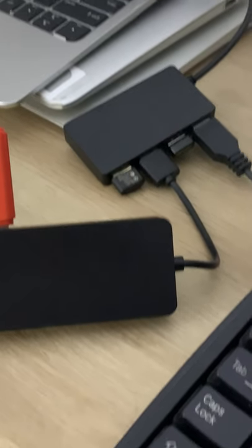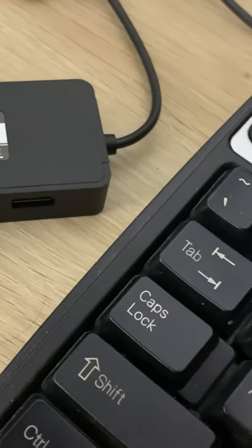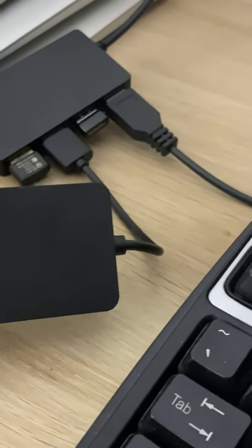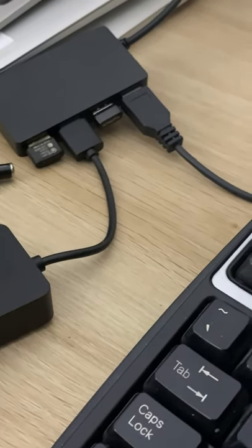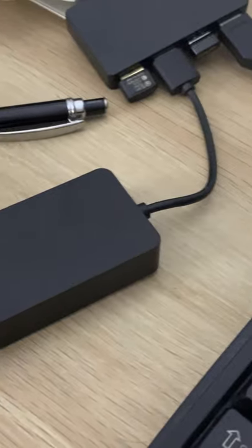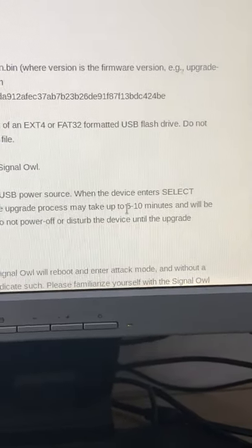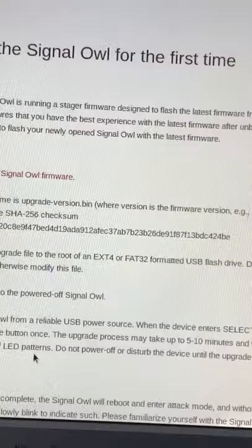The flashing red LED — I think we want to press that button once. We've got a solid red light here. Going back to the LED status page, solid red means mounting external storage, so we can be pretty confident it's loading the new software. We may have to wait five to ten minutes for that to finish and then see where to go from there.